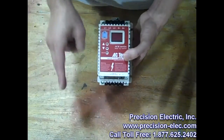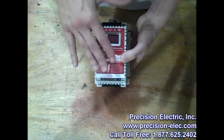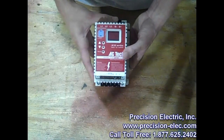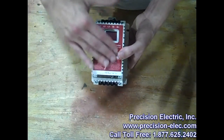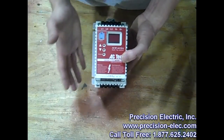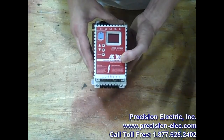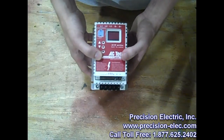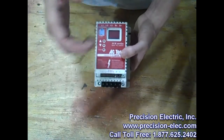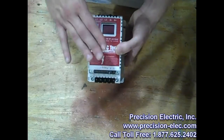Those are the two most popular purposes of the SCM. You know the difference between the versions by the color — this is the red faceplate SCM series. The SCL is the European version with a purple faceplate. It's basically the same drive, but it has a filter built into it to meet the rigorous European standards for EMI and RFI noise suppression. If you have no need to meet that standard, you won't be looking at the purple SCL series.